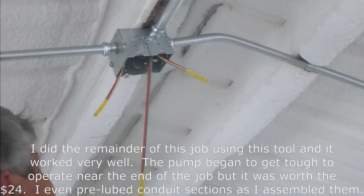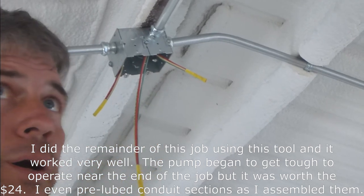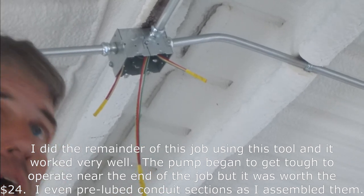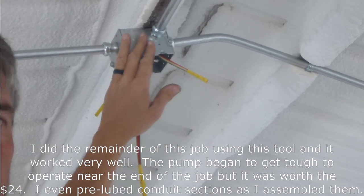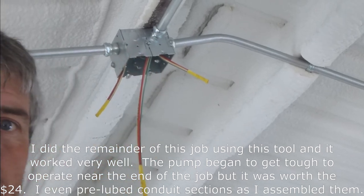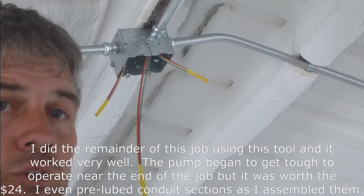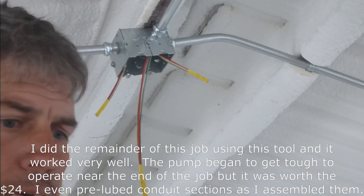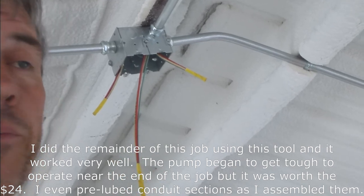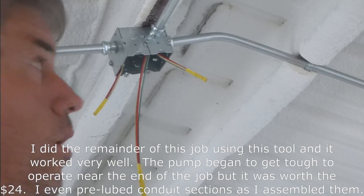And here we go — that was pretty doggone easy. Now I've got to leave a loop at that junction box, so I'm going to waste a little wire and save a little time. I'll clip this off, bend it back sharply to kind of anchor it, go back and pull my loops on the junction box. I know it's a really simple pull — only three conductors, one stranded — but that's still 240 degrees of bends and I've been having trouble pulling it dry with fewer bends than that. This works. I don't have a crew, I don't have a helper, so this is working really, really well.